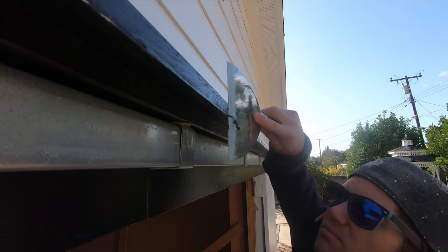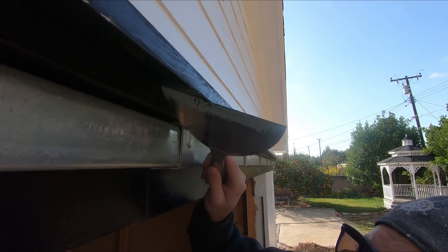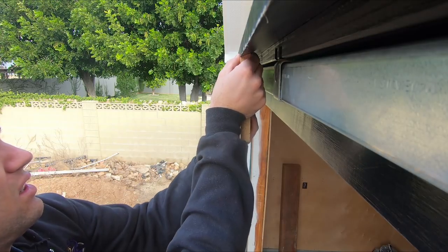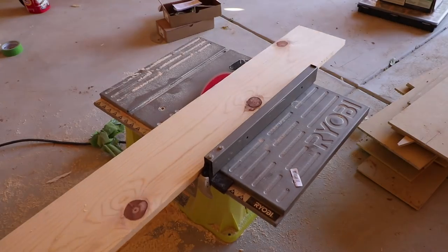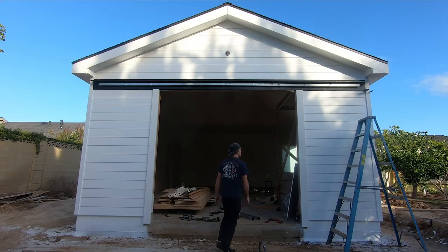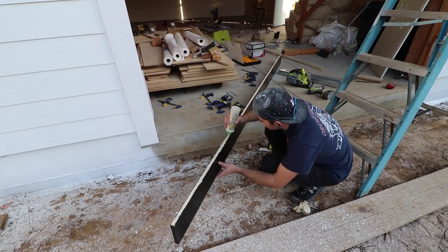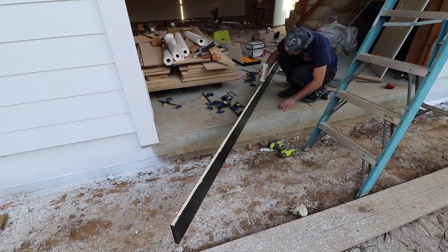I may have laid on the paint a bit thick — there was extra gloop at the edges where the next piece would attach, so I used a drywall knife to remove any paint bumps and excess. The next piece attaches to the underside of the top piece, so one edge needs to be ripped to 20 degrees and the other cut flat. To know how big to make it, I brought my sample piece to the underside and marked it at the same height as the doorway, then ripped the pieces to the right size. Just like everything else, these got painted on the ground. I glued the surface that would attach to the top piece, but realized I had forgotten to glue the other pieces — they were screwed down so well it wouldn't be an issue.